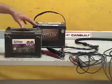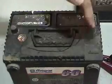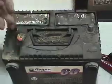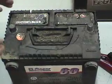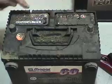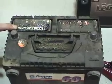A couple of things I want to note here: first, the condition of this battery. Looking at the surface condition, you can see that there is a lot of corrosion on the top of the battery and a lot of dirt. This has been packed away inside one of the battery boxes on a functioning unit. The important part here is knowing the exact size and available cranking amperage that the battery does hold.